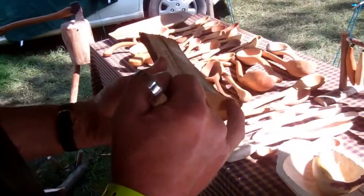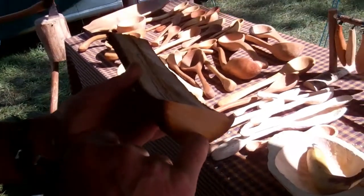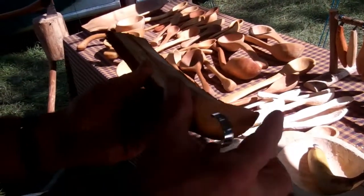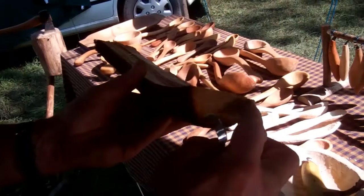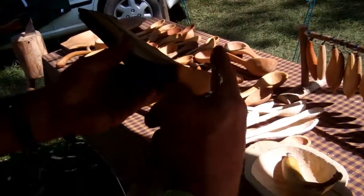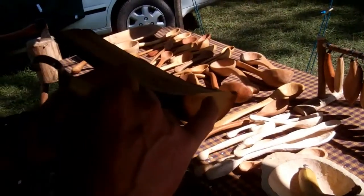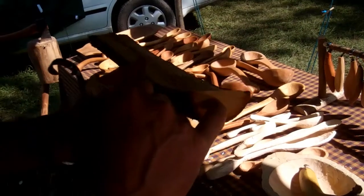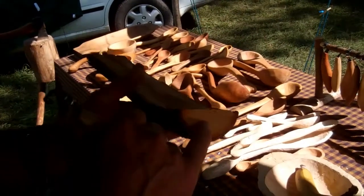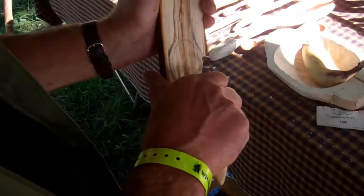These sort of annual rings, along these annual rings. So obviously the outer ring is longer than this one, so it will tend to shrink more along that big ring. So the top surface will end up bending downwards at the sides. It also loses moisture from the ends of the fibres much more quickly than from the sides of the fibre. So we remove as much bulk as we can, as quickly as we can, to avoid that happening.